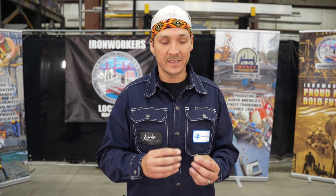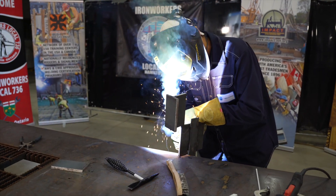As everything starts to cool off, that gas tries to escape, leaving a small indent in that weld metal. Now as long as there is no porosity or anything deeper down in that weld, most would consider it a cosmetic defect. As always, it's very important to recognize that we're wearing the proper PPE for the task we're doing: welding helmet, gloves, long sleeves, and of course our safety glasses.